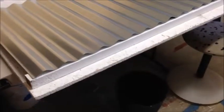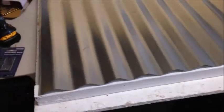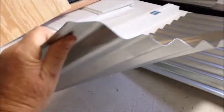Take the 48 inch piece of 2x2, place it underneath two metal panels with the hem side down. Balance it out so that there is a little bit of white showing on both sides and along the edges — that prevents people from getting poked by the sharp edge. Start by putting the first screw in the middle of the roof, then put one at either end, and fill in every two or three ridges.